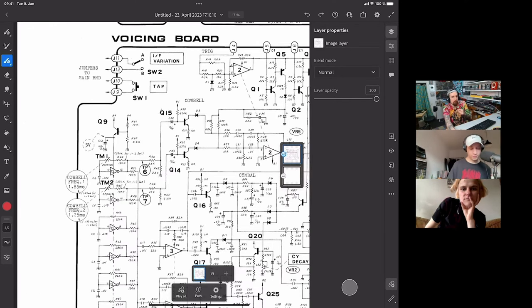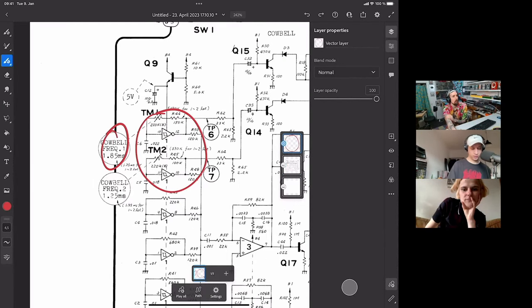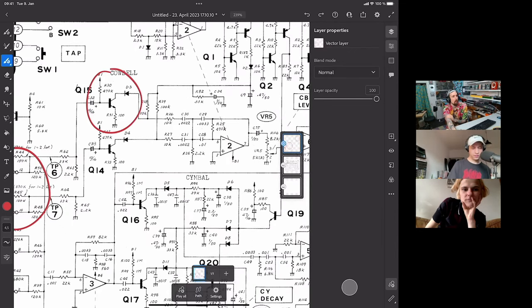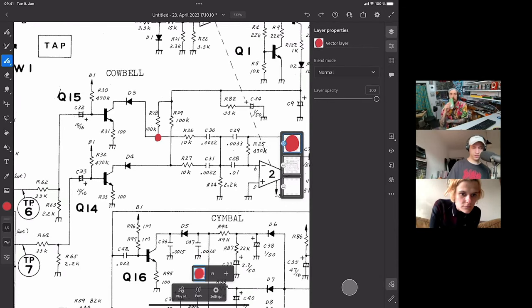So to recap, we did these two oscillators. We tuned them to the values that are specified here. We set up these VCAs and made them work by buffering the output. We learned that if you don't buffer the outputs, which we take from this point and this point respectively, you're going to have a bad time. So if you want to use this VCA, always buffer.